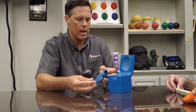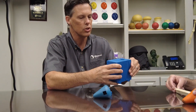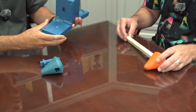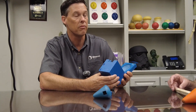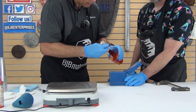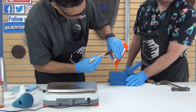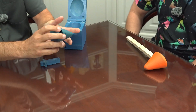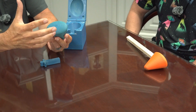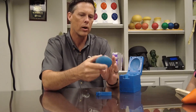Breaking it down into simple shapes, the mold has a multi-hinged design. Hinges are a very under-talked-about feature of foam tooling. Foams tend to be very fast-reacting — you mix the material, pour it into the mold, and then it's all hands on deck needing extra hands for clamps. What's nice about tooling like this is the mold is open, you pour material in, and then slam it shut. The three-piece design exists because the foam needs to be poured in somewhere — the aesthetic top didn't want a rough fill port, so the goal was to pour from the bottom.